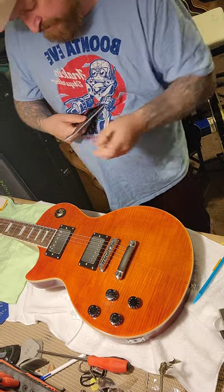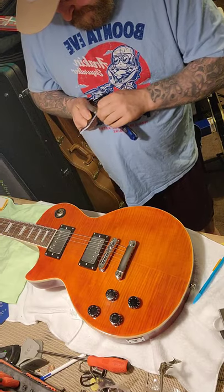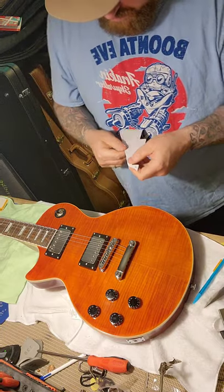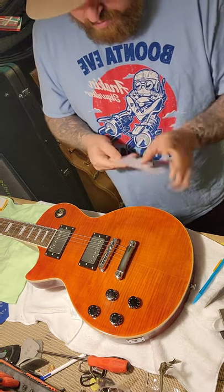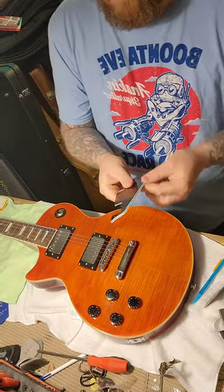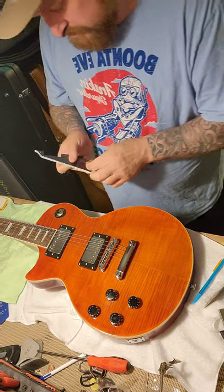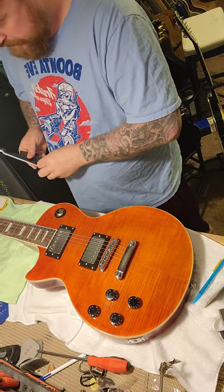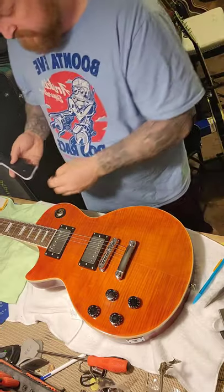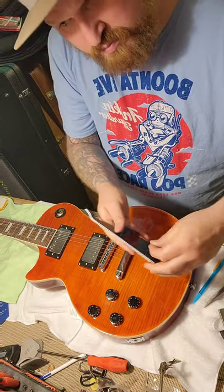That feels a lot better. Take it down just a little bit more — that's pretty good. You can do that with sandpaper or whatever, but I just find scraping does the job. Next I'm going to go ahead and install this piece here. On this one it feels like — and it is — this hole isn't big enough for the bolt to go in. So I'm going to have to ream out that bolt hole. Let's get going on that.